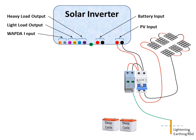If the inverter is 24-volt rated, then connect two batteries in series, but if the inverter is 48-volt rated, then connect four batteries in series or install a 48-volt dry battery. Connect these batteries to the battery input terminal through a 63 ampere or 125 ampere DC breaker depending upon the inverter battery current input capacity. Don't connect batteries without a circuit breaker because then the battery can't be isolated.